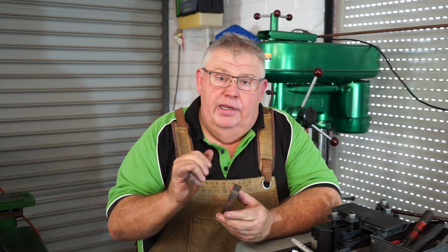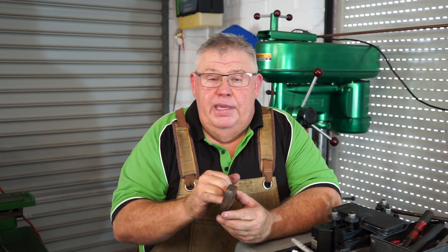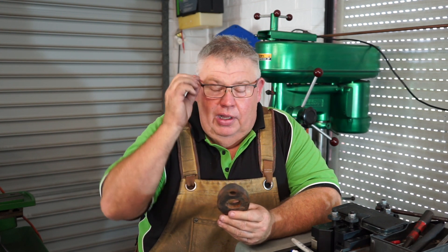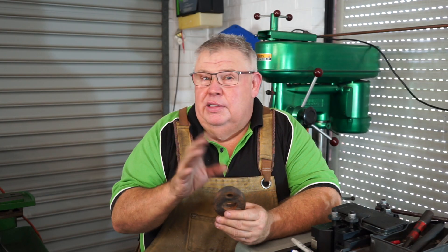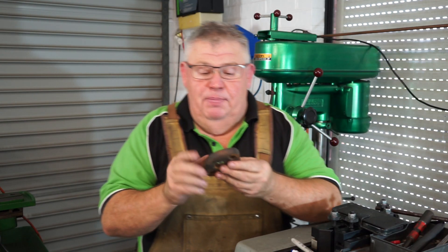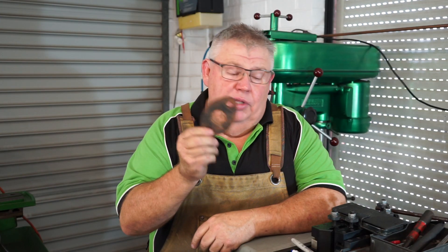However, in the last operation I had to hold them in the four-jaw chuck and single point thread cut a BSPP thread. Now I believe it's an inch thread. When I first looked at this, I thought it was an inch and a quarter, however it measured that, but with BSPP thread I looked in the book and it says you've got to deduct a quarter of an inch — so God knows what they were thinking when they invented this thread. But anyway, so it's an inch BSPP, and I had to cut that thread for them as well. There were two of those to do.